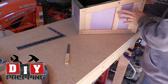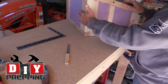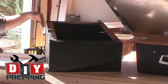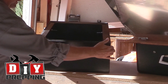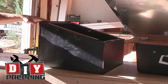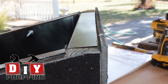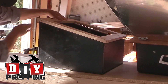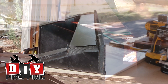Once you have all of those in place — the cardboard along with the insulation — I moved on to cutting the side panels. I didn't get any video footage of this, but I cut the two sides first and then the front and back. That's because for the front and back you want it to be the width of the box with the side panels on, so it was easier to measure with those on. I also made the back of the box a half inch taller than the box itself, because the back post lays flat and when I put that piece on I want it to stay in place and have the back closed rather than having a gap that needs to be sealed up. So I made sure to cut that a little bit longer.